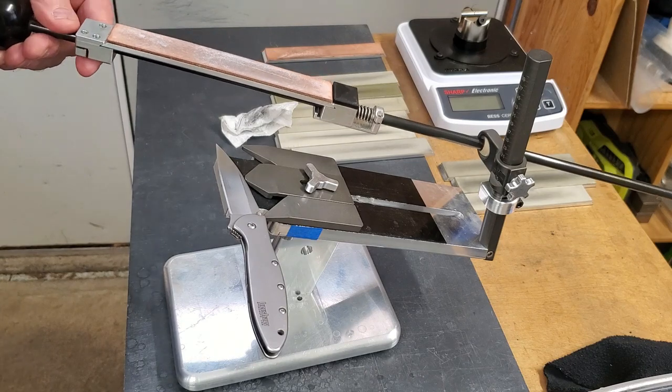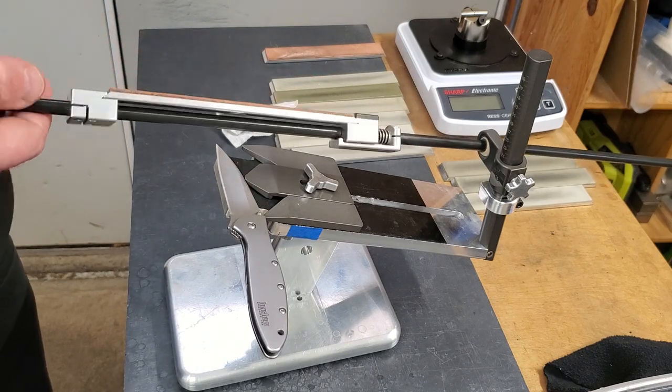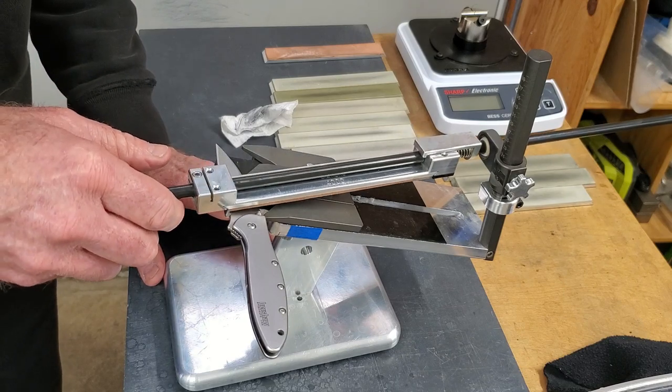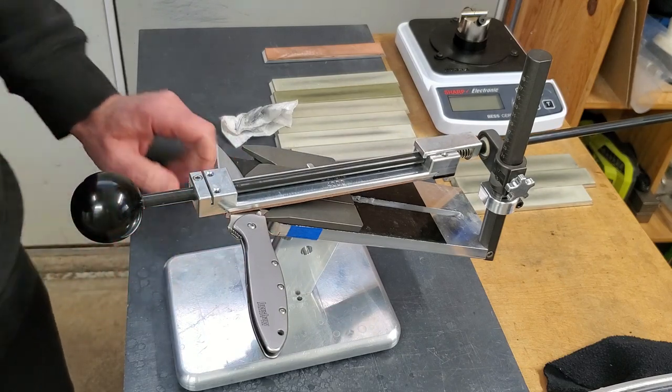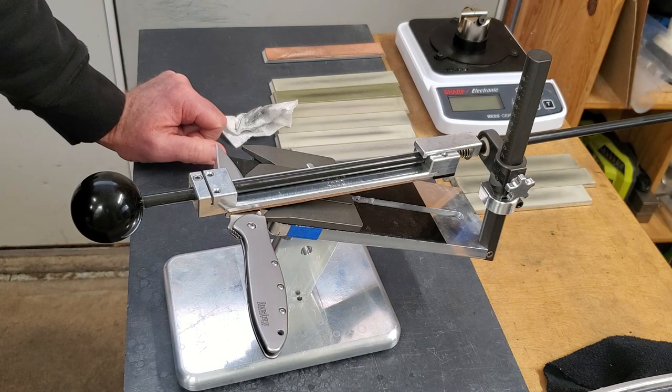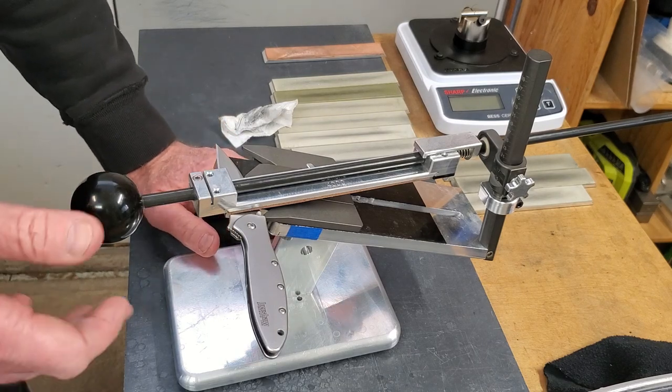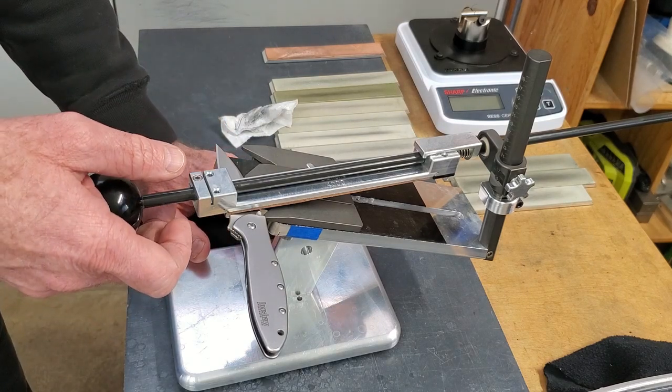This isn't a good hard steel, so diamond is too aggressive for it, since I'm just wanting to lightly deburr it. Also, I guess the strop is about twenty thousandths of an inch thinner than the stone, but I do want to make sure I'm getting to the apex with the strop.